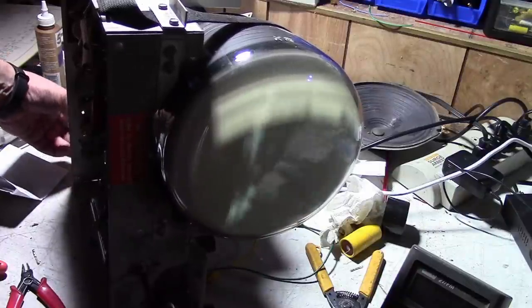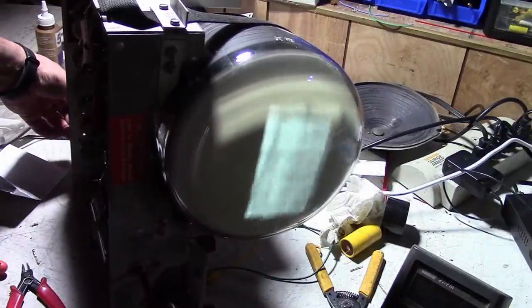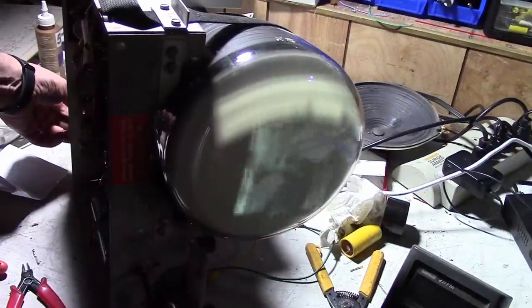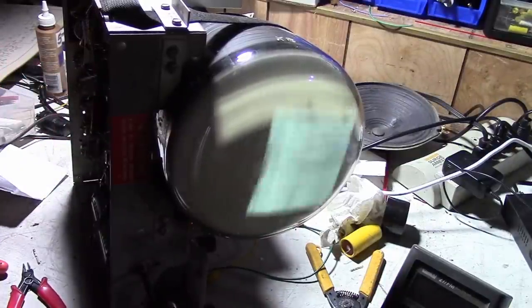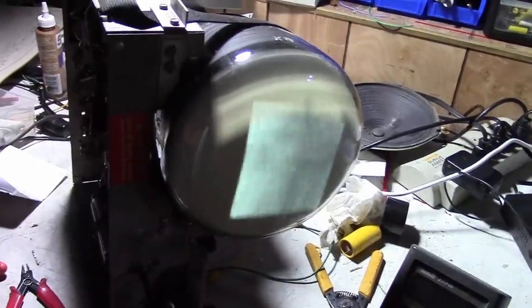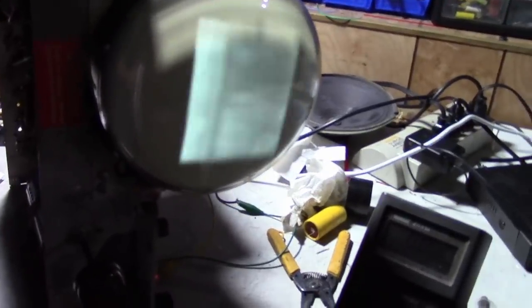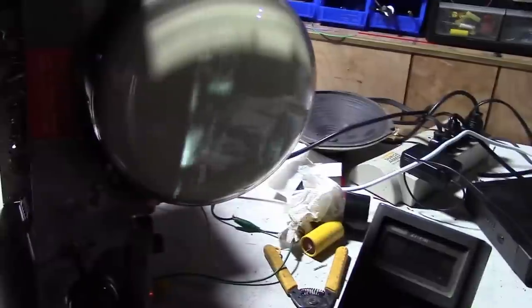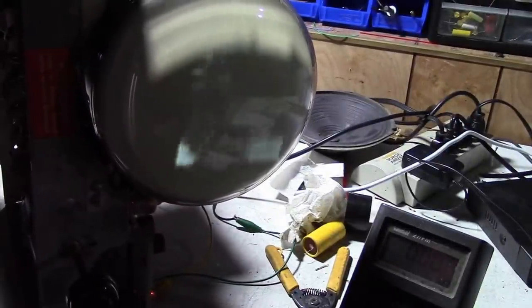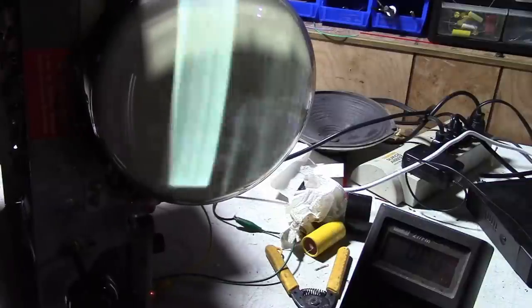If you're wondering why it always seems like the vertical circuit has more issues, that's because vertical circuits run on lower frequency, which means bigger capacitors, which means there are issues with the caps. They are more pronounced. Boy, it's trying to work.